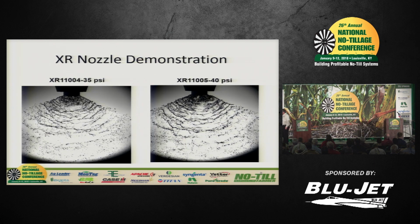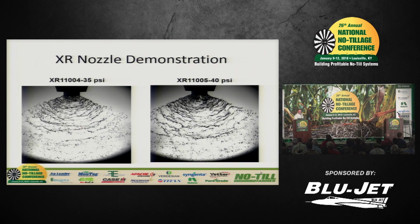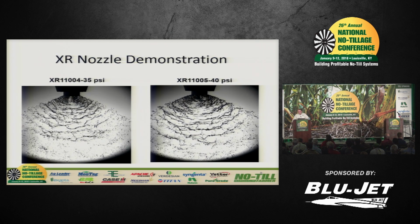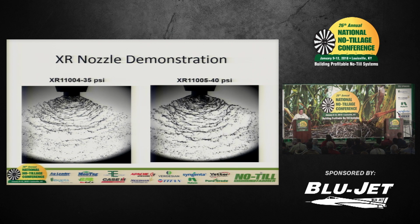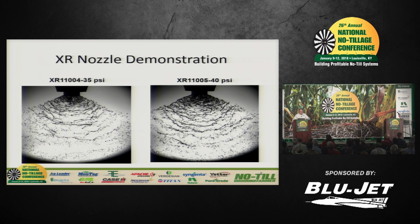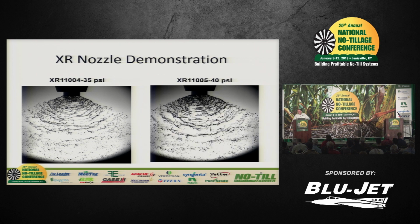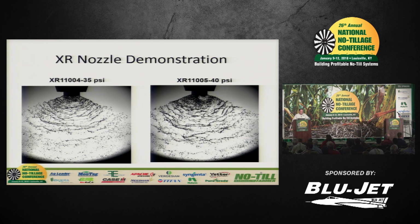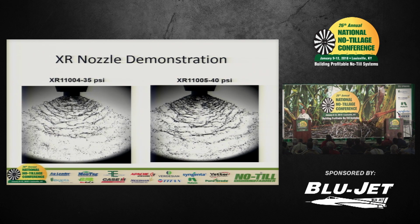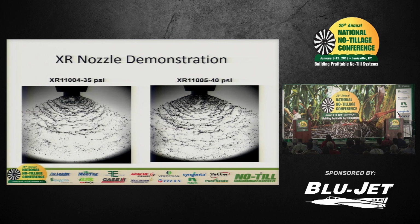Now let's take this to the image set. So I've got two XR flat fans spraying here, one at 35 PSI, one at 40. One's an 04 orifice, one's an 05. The 05 is a bigger orifice. We've always advised you, as one method to reduce spray drift, to use a bigger orifice at a higher gallons per acre and a lower pressure. Now that lower pressure is not really a factor on this screen, but you can see that the 05 probably has just a little bit bigger droplet spectrum. Now I want you to keep those droplets in mind as I move through this talk, and at the end I'll bring those pictures back as a comparison.